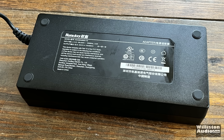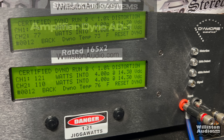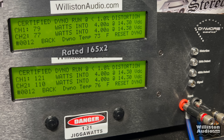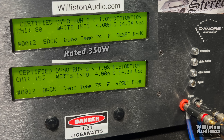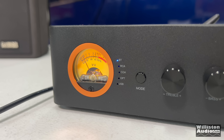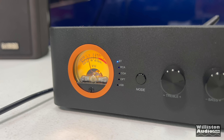As promised, we're going to try the 48-volt 10-amp power supply that should have definitely come with this amp. Let's try the front channels certified to 1% distortion at 1 kilohertz. We get 121 and 110 watts versus 79 and 77 with the included supply — so about 50 more watts per channel using the bigger power supply. Now trying the sub-channel with the bigger supply: certified test at 40 hertz up to 1% distortion gives us 193 watts, versus only 80 watts with the smaller power supply. However, it's rated 350 watts at 4 ohms and we got 193, so still well shy of that rating. Fosi needs to work on that. Thanks as always for watching — more videos coming. Until next time, Big D, I'm out!